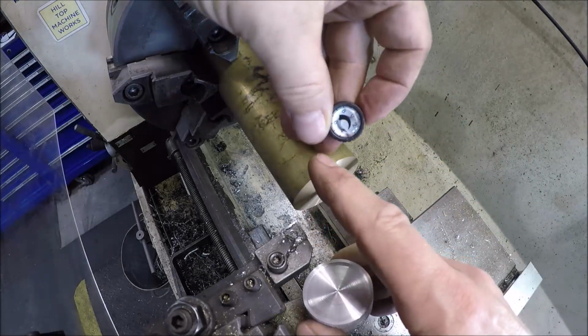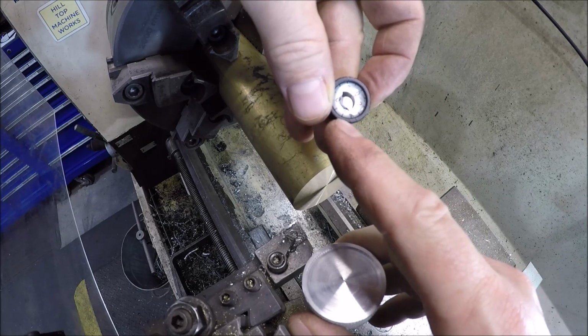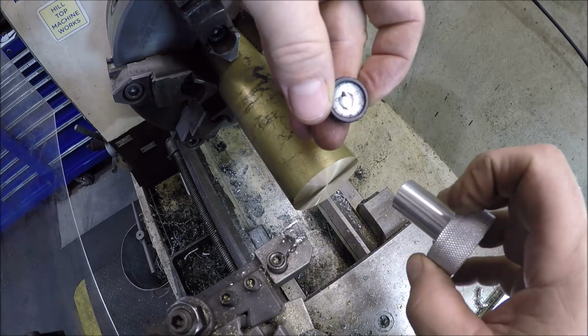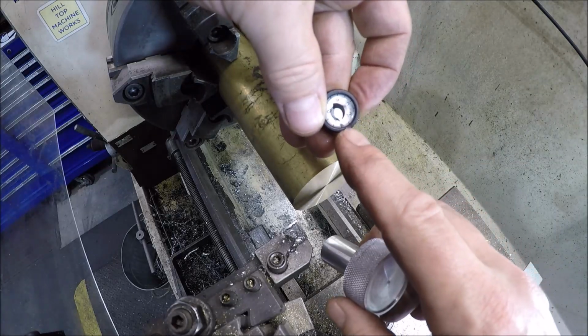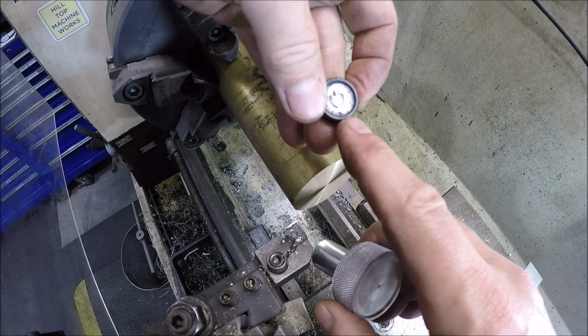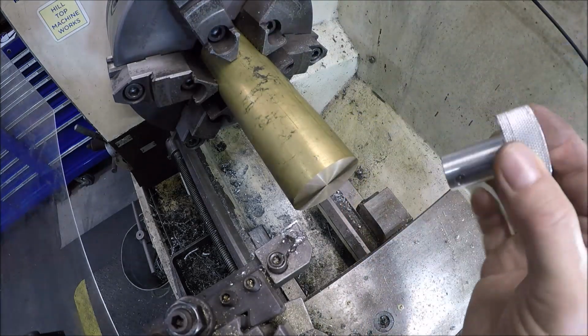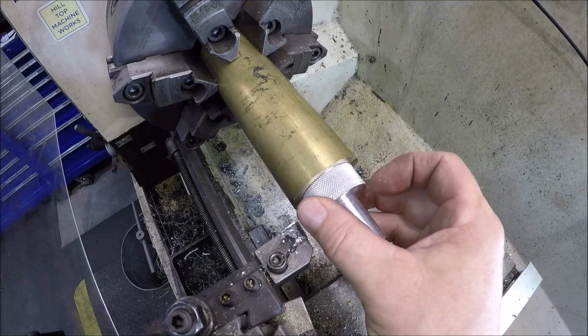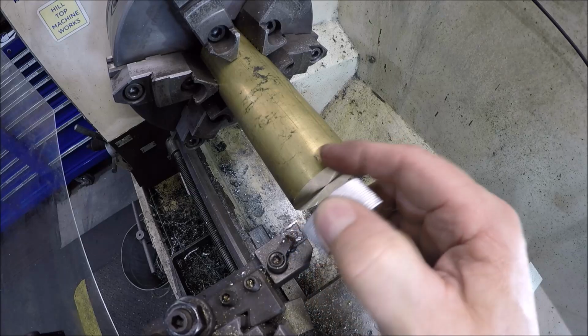This is the old one, where it had the graduations in here, so you got a reference point, if you release the pressure and you pick the saw up and you bring her back down, and you can get her back to the spot that you like. So we're going to do something like that in here on this piece of brass. Unfortunately, I don't have anything smaller diameter, so we got a ways to whittle, but we don't have to go in very far.